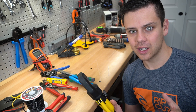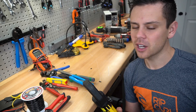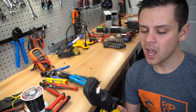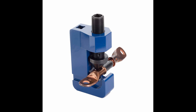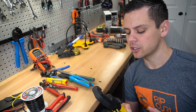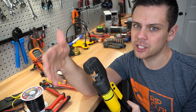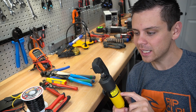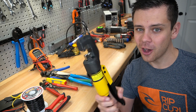When it comes to large gauge wires, there are lots of options. If you're only building one solar power system, the hammer type crimp is great — I've gone through about three of them. But for everyday use with a perfect crimp that matters, I would go with a hydraulic crimper. I also have a three-point crimper which works great for 2-aught or 4-aught gauge wire, but anything less than 2 gauge I do not like using it. What I like about hydraulic crimpers is whether you have a thick jacket or it's 4-aught or 2 gauge, it gives consistent results. These do like to break and leak though — I've had one leak before, but it was a cheap Harbor Freight one.